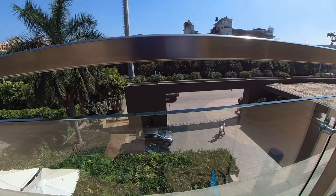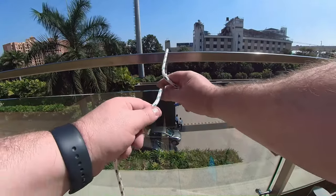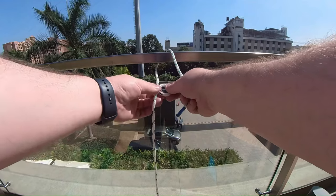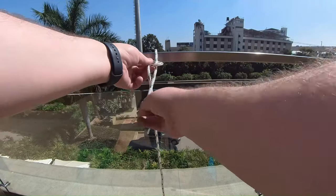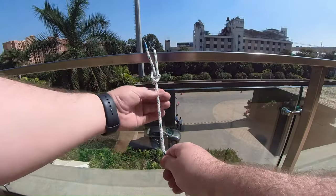I'm going to start with the bowline. There's a railing to the left over here, and basically I'm going to use that to tie a bowline around. The bowline is a great knot for things like the jib sheets — you tie your jib sheets to your sail using this knot. You thread the line through the hole in the jib, make a turn so the line going back to the cockpit is on top, then go through, around, and back up. And it's as simple as that. That's the bowline.